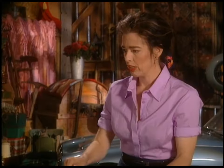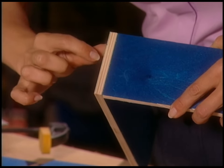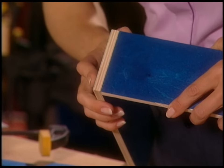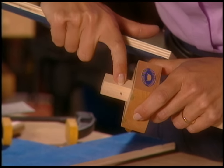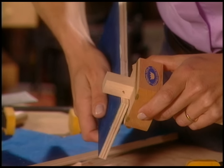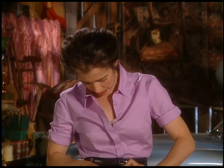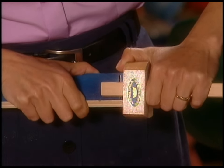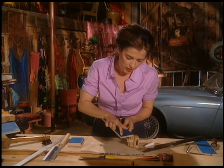The first thing you have to do once you've got your wood cut is mark the ends of the board. I want to make a mark that tells me how deep my little finger joints have to be, so they'll go just the depth of the other board. I could trace a line, or I could buy the thirty-dollar scribing tool at a specialty woodworking shop, which is of course what I did. It has a little pin and you can adjust it to the exact depth of the wood, and then just scribe a really precise line across the end of the wood.